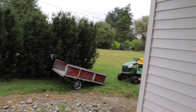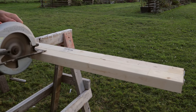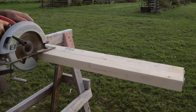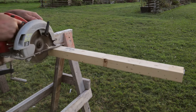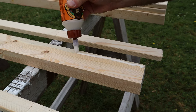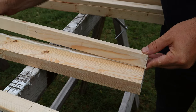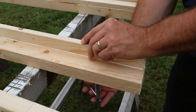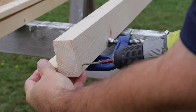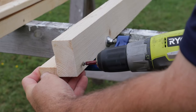For the rails I'm using cheap dimensional lumber — 1x2s and 2x3s. I'll cut them down to a six-foot length because once installed vertically that's the height I want to stack the slats into. Applying some glue to the broad side of the 2x3, I take a 1x2 and lay it on edge right at the back edge of that 2x3 and clamp it down. With the 1x2 clamped on both ends, I roll it forward and apply a screw through the back edge of the rail.